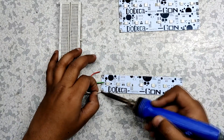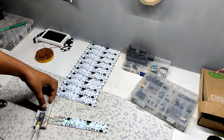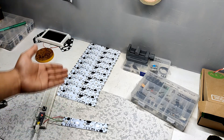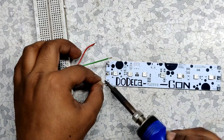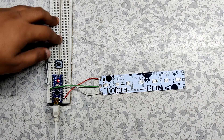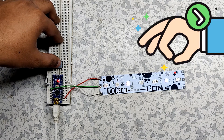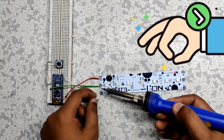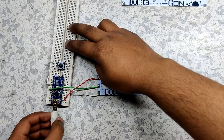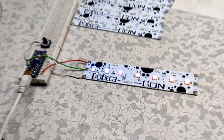Now before the final assembly, we need to check each PCB as they might not work due to improper solder paste application. To test each board, I prepared a setup with an Arduino Nano connected with a push button. I uploaded a button-cycler sketch which changes the color of the WS2812B LEDs on button press. We manually solder VCC, GND, and DIN port to 5V, GND, and D6 of the Arduino Nano board. If the PCB is shorted, the setup won't work. If it does work, the setup is perfectly soldered and we move on to the next PCB. After checking all the boards, all that's left is the final assembly.